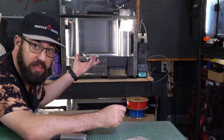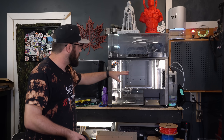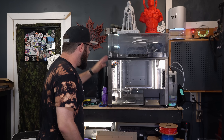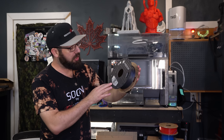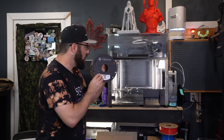But I do have a bunch of 3D printers, including this Pantheon. The Pantheon is a pretty beefy 3D printer — it's all ball screws, it's an industrial design, and it's got a hot end that can get up to 500 degrees Celsius. The chamber gets pretty hot as well, which means we can print some pretty high-end material.